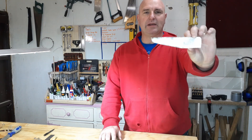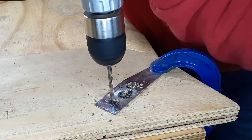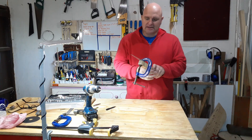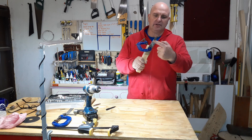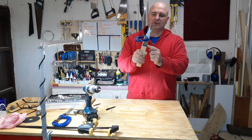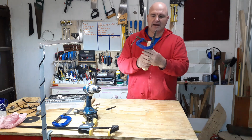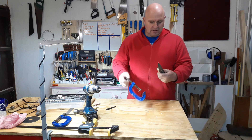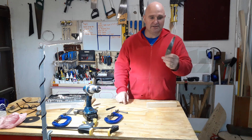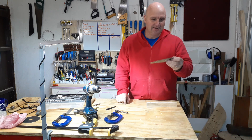So now I'm going to quickly drill the three holes. I drilled the holes into the metal and then clamped it onto the wood so that I can precisely drill the holes through the wood so they will line up. I have to note that drilling into hardened steel is a lot different than drilling into mild steel - this was quite a story to get through.